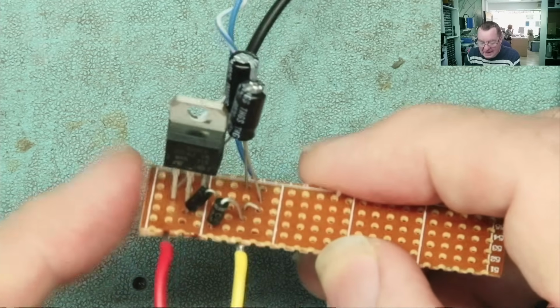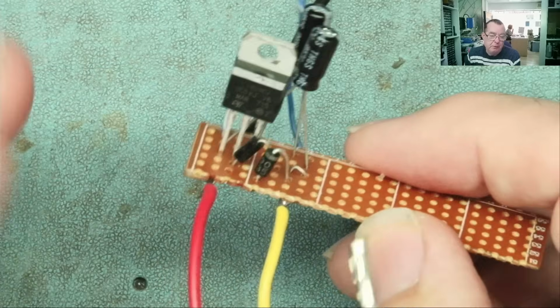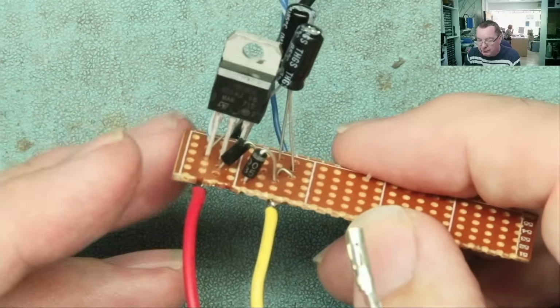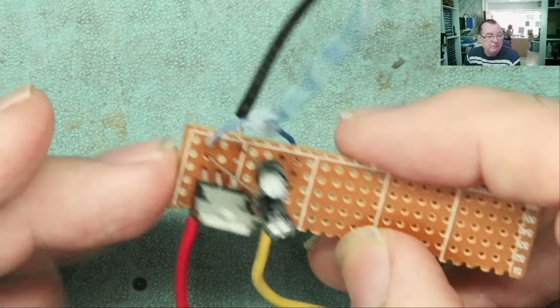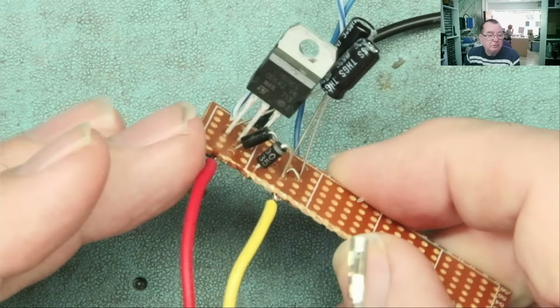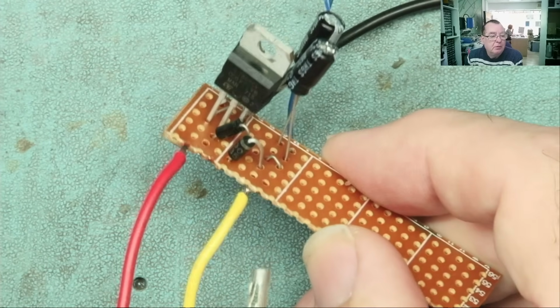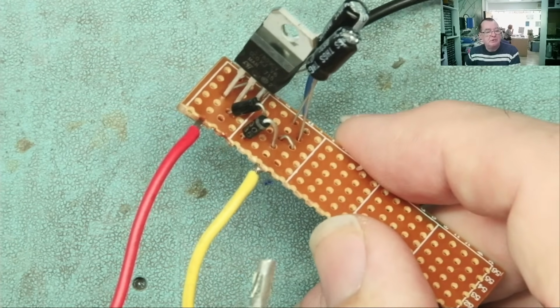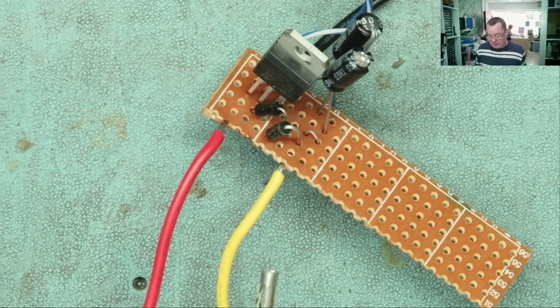What happened is that the positive supply went up to roughly 14.5 volts, and the negative supply went down to about -5. So effectively, the ground was shifted. The total voltage was still correct, 20 or thereabouts, but the actual position of the ground changed. So we disconnected and didn't want to connect it again. It didn't damage the drum machine, because you saw after that we did Det's method and that worked fine.